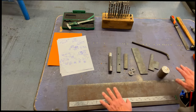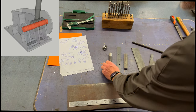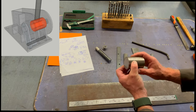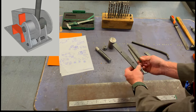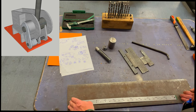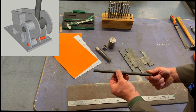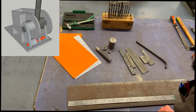Here's the array of scrap materials that are going to become the rebar bender. We need a centre pin which is about 24mm diameter and we've got this bar stock which is pretty close. The centre pin is going to go through the boss for the handle and I've got a bit of 50mm 2-inch diameter bar stock here for that. We've also got these small pieces of 6mm plate for our stops, a large piece of 6mm quarter-inch thick flat bar about 800mm — around 30 inches in length — and finally this 12mm rod.